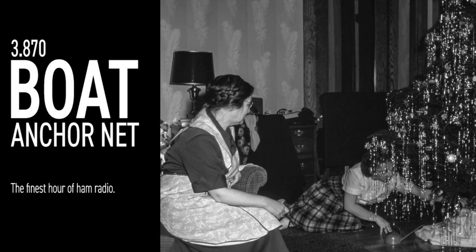Sure, go ahead, Lynn. I was going to turn it to you for that anyway. Can you send me a picture? Yeah, I can try. It says on the schematic it's 3 picofarad between the crystal and one of the tube leads. And when I actually look at it, it says 2.7 picofarad. It's white, quite small. Yeah, send me a picture, and we'll look up on the schematic. We'll get it figured out. Okay, thank you, Lynn. I'll do it.